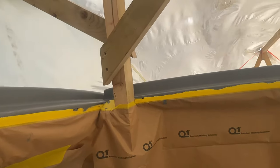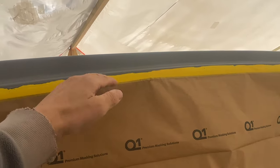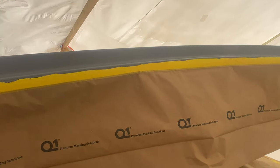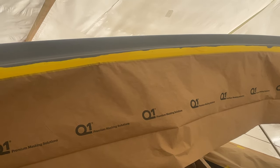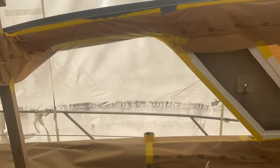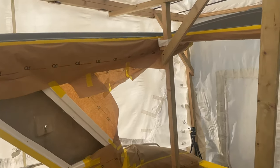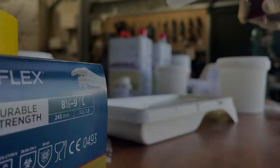So what we're going to do is just warm the boat up a little bit, or warm up inside here. We've got the heater running, you can possibly hear it. So we're just going to let it warm up for probably half an hour. It's quite cool overnight, 6-7 degrees, and we really need around 15 degrees to be working with the Alexseal paint. So we'll get it warmed up, we'll get some more paint mixed, and we'll get some more primer on.